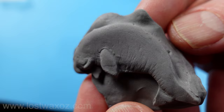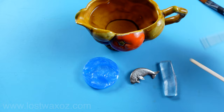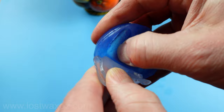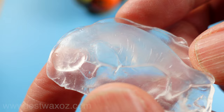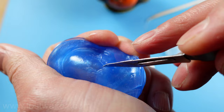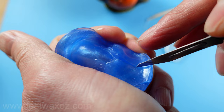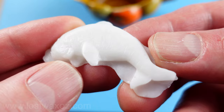But is that really enough dugongs for one person? I didn't think so. So I thought I'd test if you could use an Oyumaru mold to make an Oyumaru dugong. I squished the clear Oyumaru into the mold, waited for it to cool, and was able to pull the two pieces apart — which is really cool because it means this product will be good for making two-part molds as well. Clear rubber dugong — nice. I also tried with another thermoplastic, polycaprolactone or PCL, and it worked too. One thing I did was cut air vents at the tips of the fins to prevent air from getting trapped and stopping a complete fill of the mold.